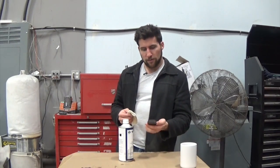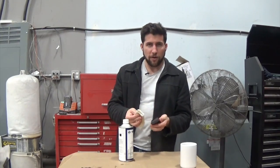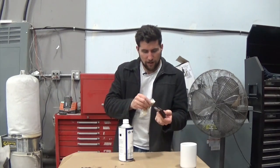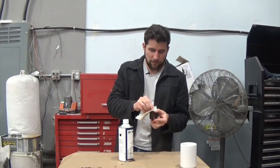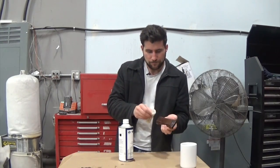So it's pretty easy to tell. You just move it around. You see some spots are shiny, some aren't. I don't bother to try and apply it only to those that aren't shiny. I just go in and basically reapply another coat. Not as wet this time because a lot of it is already absorbed into the wood and there's no need to put quite as much on.